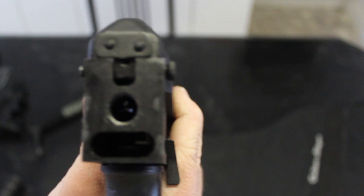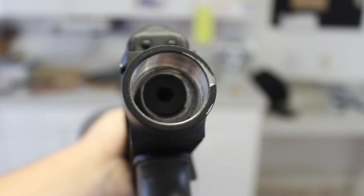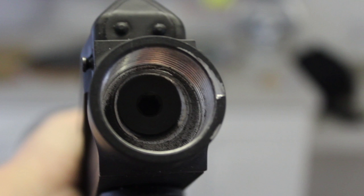Let me show you guys this — we're doing this very unprofessionally, one take. Showing you the bottom of the gun — that's what the bottom looks like. You put the adapter on; before, you couldn't see that whole hole. As you see, I had to drill out a lot, and once I did that I was able to put that screw in. I tightened that screw probably 15 or 16 times to make sure it would sink right. That's actually really tight down. You do have that little gap in the bottom, but once I apply threadlocker, everything will be great.